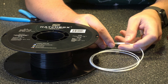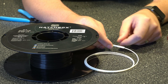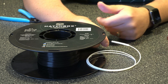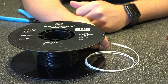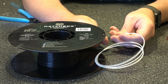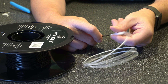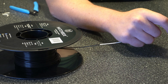Once I pushed them together in the tube, I heated it back up for a couple seconds and turned it a little bit just to attach it better, then let it cool down. We should have a decent fuse, but we'll most likely have to sand it down. Even with tools designed for this process you're still going to end up having to sand it down. Overall this looks pretty good — I can slide the tubing back off, but there is some resistance, so we'll want to sand that down to avoid potential jams in the printer.